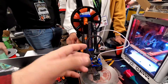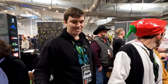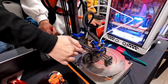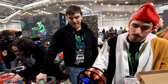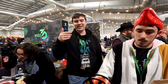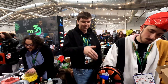So what did you have to do to make Klipper work? Normal Klipper doesn't do this. A lot. There are a couple of firmware things we have to do. The biggest thing is that if the bed spins at a set velocity and you move, the nozzle speed is one thing at the edge of the bed and one thing at the center — it scales as you get closer to origin. We had to basically scale the moves, but in Klipper a move is at one given velocity. So we have to segment the move into a bunch of tiny moves and scale the velocity based on that. We also need to respect the maximum velocity and acceleration of the bed stepper, so we have separate acceleration limits for the bed and for X and Z.